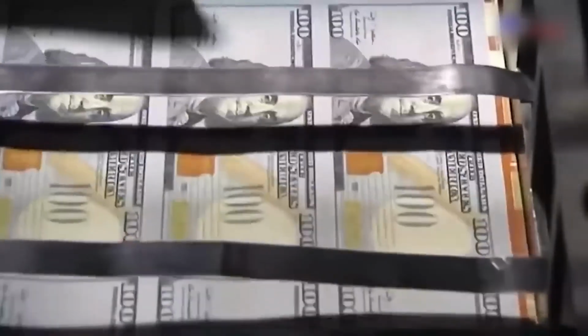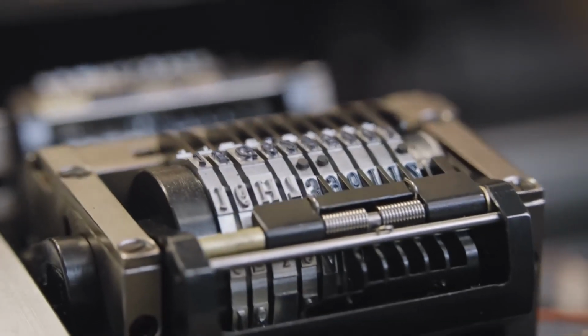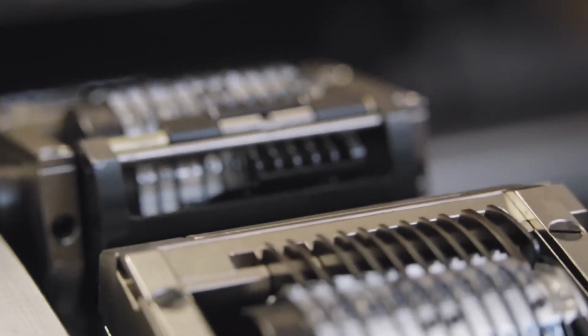The banknotes, which have already undergone the intaglio printing and other printing processes, are fed into the numbering press. The machine is designed to handle the specific dimensions of the banknotes. A combination of letters and numbers is applied using the letterpress printing technique. Each banknote is unique and clearly identifiable.